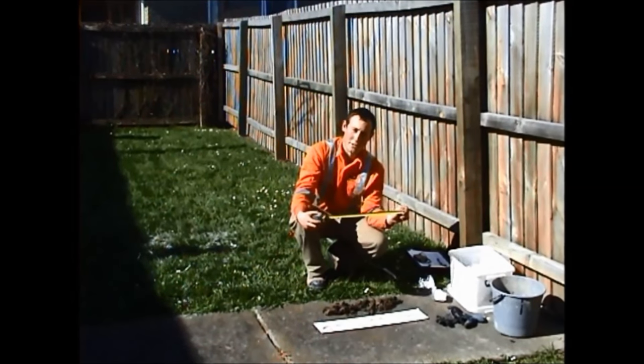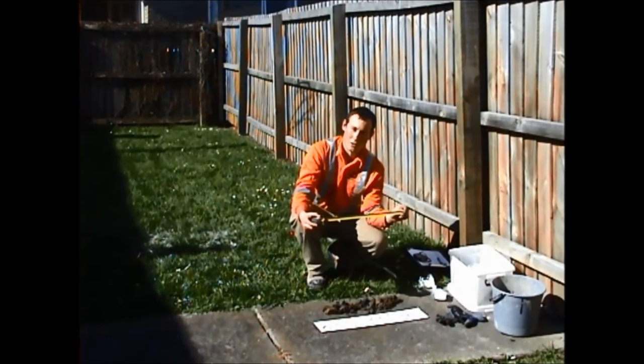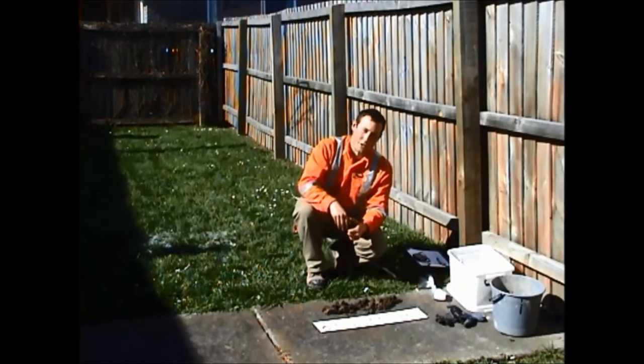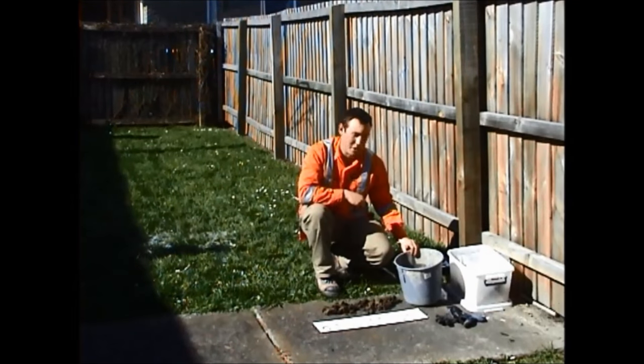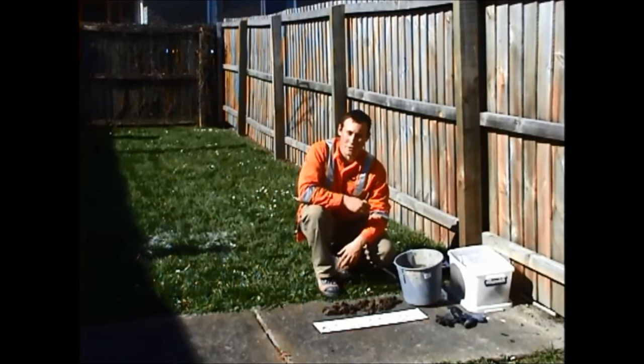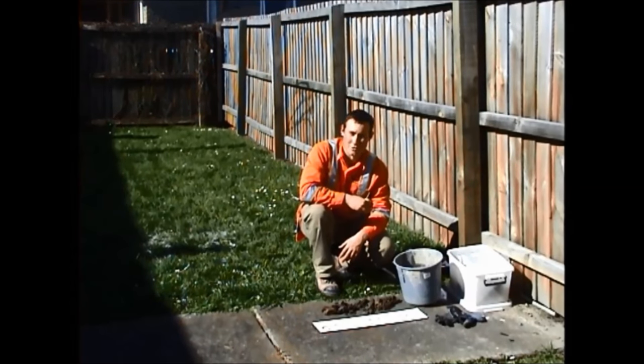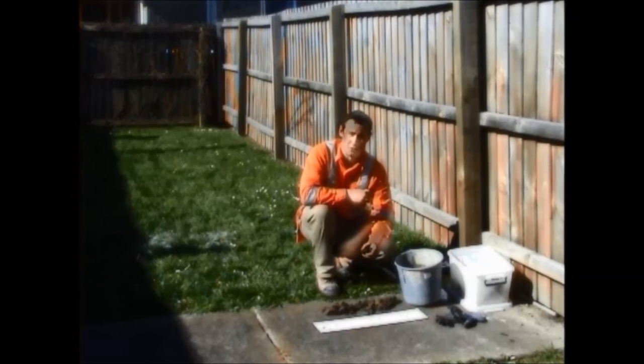It's also handy to have a tape measure just to know how far down the hole is and to measure out any changes in the type of soil or subsoil. It's also a good idea to have water with you — this helps with soil classification, and we should always be logging to the New Zealand Geotechnical Society's guidelines. One thing it helps with is plasticity: whether it's high plasticity, low plasticity, or not plastic at all.